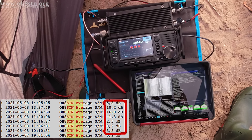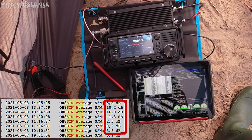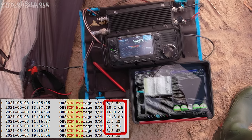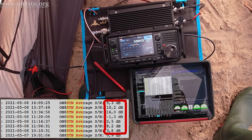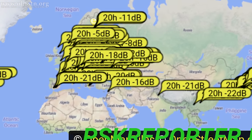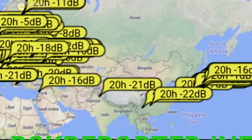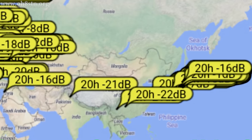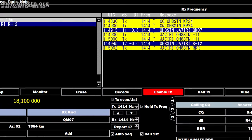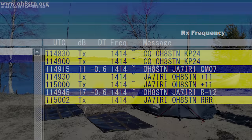The 2.5 dB, 3.8 dB, and minus 1.3 dB SNR readings were all with 5 watts from the IC705. The 8.2 and 5.3 dB were with 10 watts from the ICOM IC705. The 16 and 10.2 dB were from the PA500 being driven by the ICOM IC705 with just 1 watt. I'm not a big fan of FT8 for casual communications, but for testing it's absolutely magnificent. My little station with the 705, the Chameleon MPAS 2.0, and the DIY 599 PA500 identified as a big gun station that day. Although I made contacts in North America, throughout Europe and Asia, it was Japan and South Korea blowing my mind about this new station configuration.